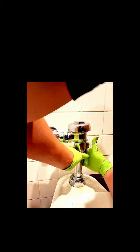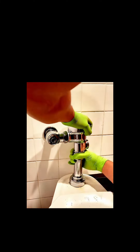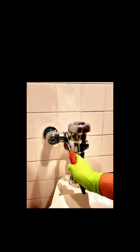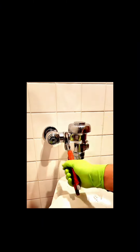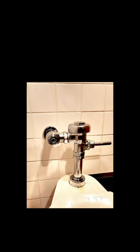Now we're putting on the body of the flushometer — the main part, the engine. We pop it right on in there, then secure those coupling nuts. You can see we tighten them by hand first, and after we get them nice and secure and straight, we bring out the pliers and tighten them up. You want to preferably use smooth-jaw pliers so you don't get any scratches on it — no need to add insult to injury after nearly flooding the restaurant. Now the handle is on.